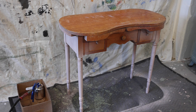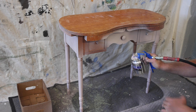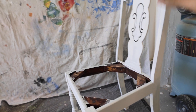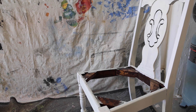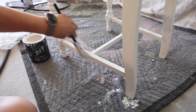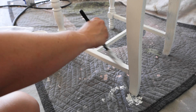I've got it flipped right side up with one coat on the legs. It's drying really fast because it's pretty thin. I let the milk paint sit for just a little bit and it has thickened up — it's spraying really nicely now. Second coat is going to give enough coverage to be ready to distress. I'm noticing a little bit of bleed-through in a few spots, so after distressing I'll seal it with white wax, which should lighten it up and do the trick.